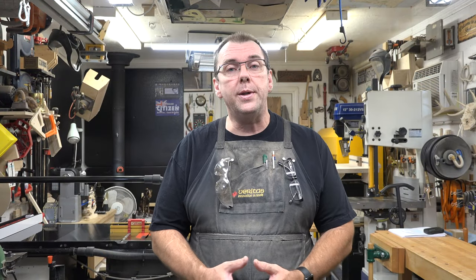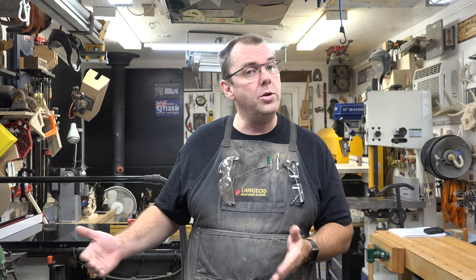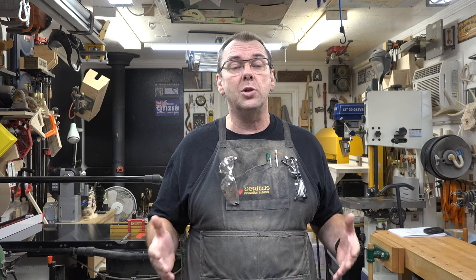Well, a shooting board is a useful and essential jig that you use in conjunction with your hand planes, and it gives you the ability to square off the ends of your stock. When cutting stock by hand using hand tools, or even when you're using your table saw, sometimes they can be a little out of square, and a shooting board tunes up those cross cuts, as well as your long grain cuts, so that you get that perfect, clean, crisp, sharp edge.